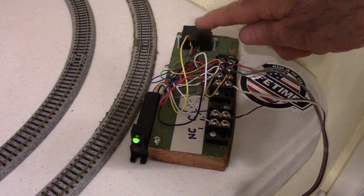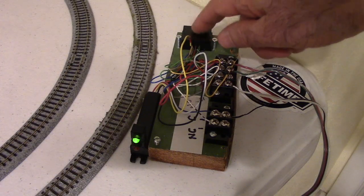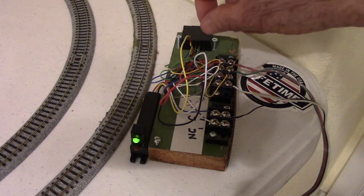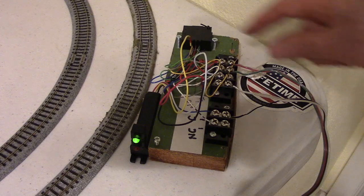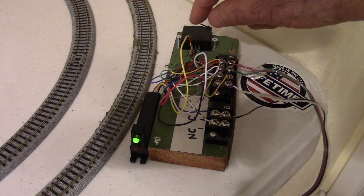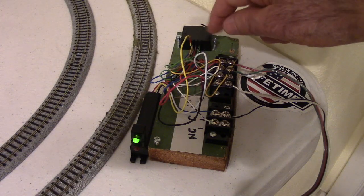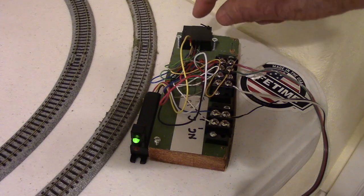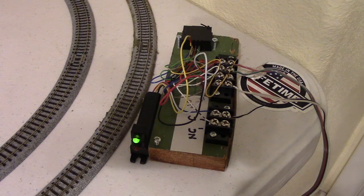And then down here is a DZ-1008 relay, which is made to operate with this detector. And all this does is close a set of points, the same as if a reed switch was closing or if you just touched 2 wires together. And it just grounds the input of the mini panel, which is how the mini panel knows that the train is there. In other words, the mini panel's inputs are made, that's basically how they work. They're set up to be grounded by either a push button or relay or something like that, or you touching wires together, something that connects that input terminal to ground. That's how the mini panel senses its input.